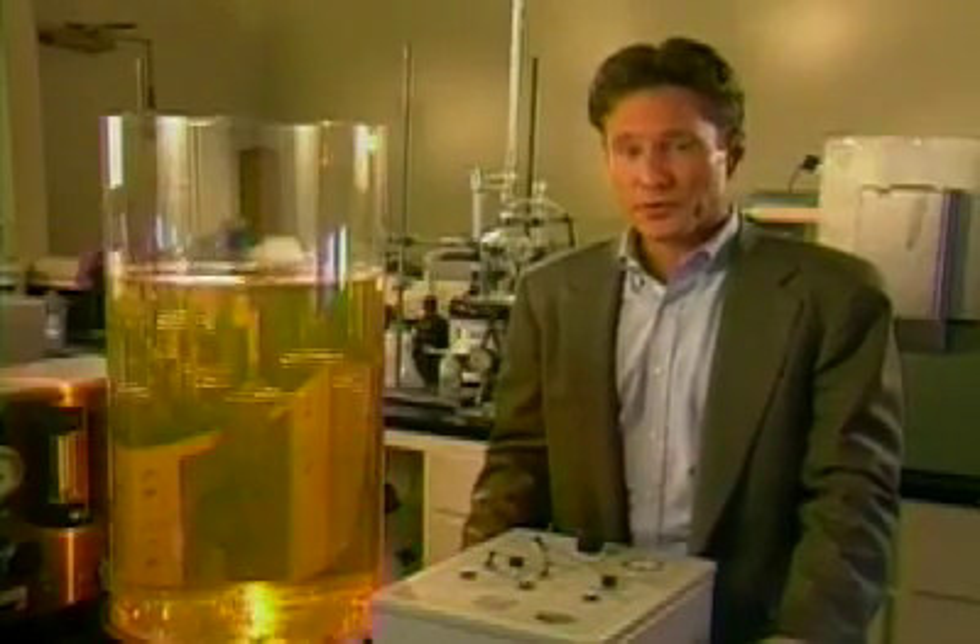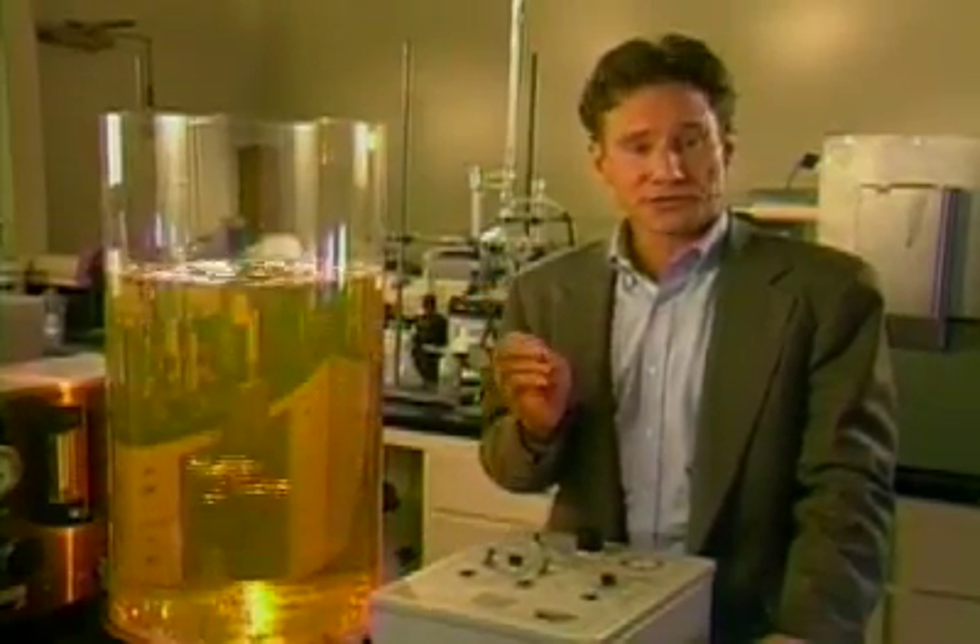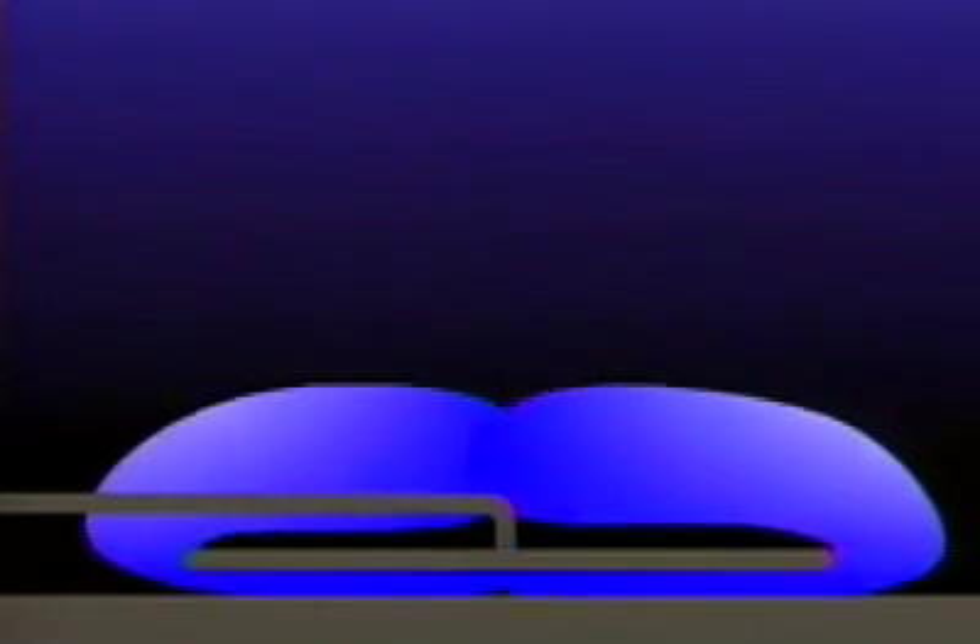Let me show you, with a few diagrams, how Pulsair builds their bubble. As the pulses are released on the underside of the accumulator plates — a plate attached to the bottom of your tank — heavier liquids are forced out and away from the plates. Then the pulses quickly wrap around the accumulator plates as the heavier particles rush back to fill the void. The pulses form large, oval-shaped bubbles, which rise toward the surface, displacing the liquids above them and pulling the bottom-level liquids upward. This creates immediate vertical circulation involving 100% of the tank's contents.